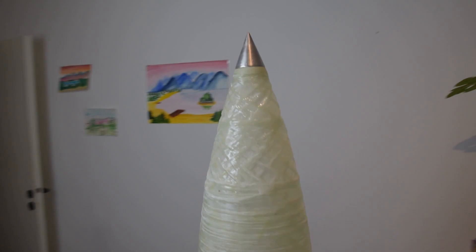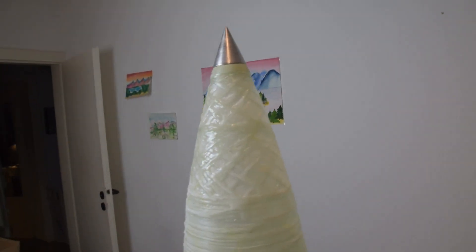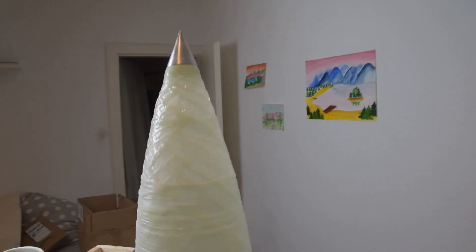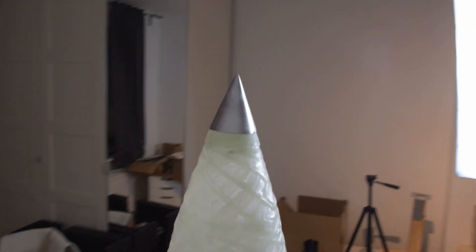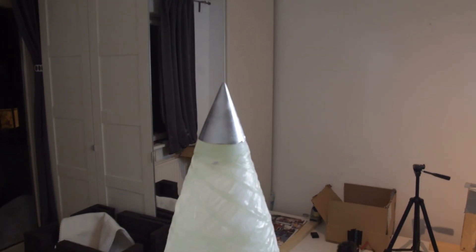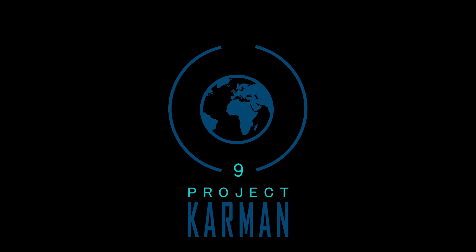In the end, this is the product that we pulled out of the sand — we have the nose cone piece, the flow channel, and after cutting off the sprue and sanding it down a little bit, this is the final aluminum nose cone we've just cast. As you can see, it's fitting in quite nicely here to the overall body of the nose cone, and I think it'll do its job very well.